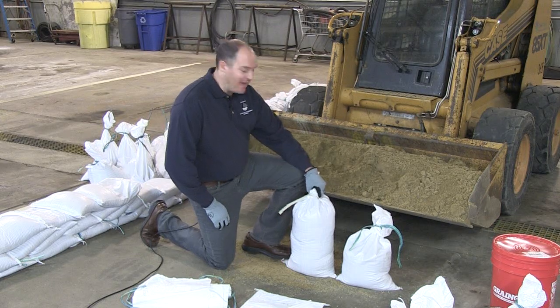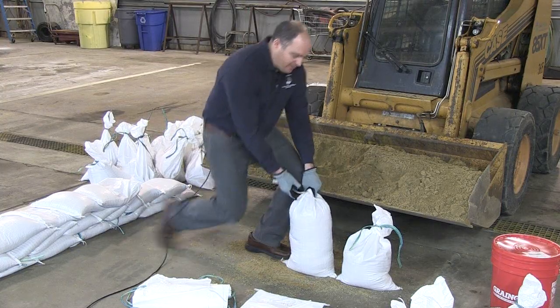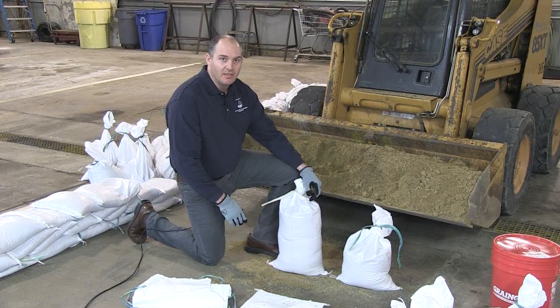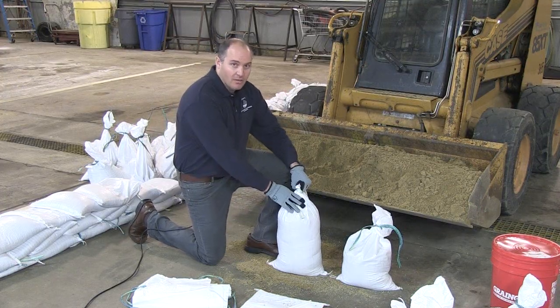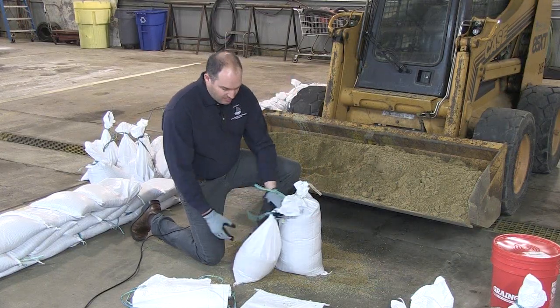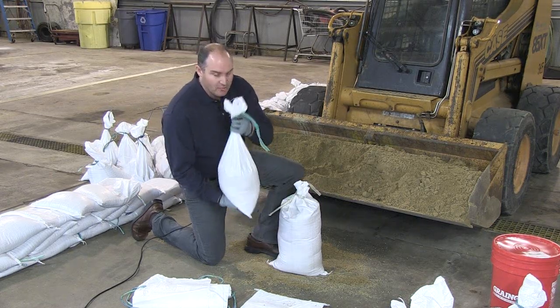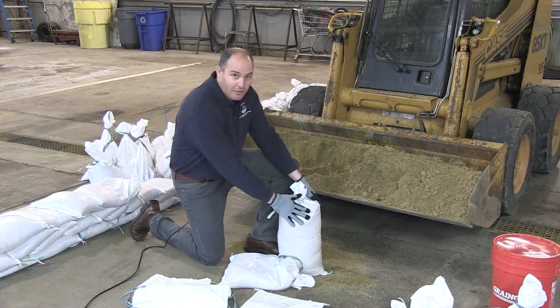This here is an overfilled bag — you don't want to overfill the bag. First, it's very heavy, and with other volunteers helping out, including teenagers and older folks, moving sandbags this way will wear people out. This here is about a half-filled sandbag, which is the proper capacity you want. It's easy to manage and better to place because when you lay it on the ground you'll be able to pack it down. When you have a full bag, it's hard to compact and form into place.